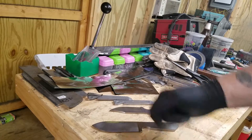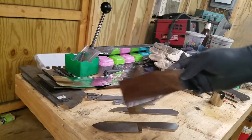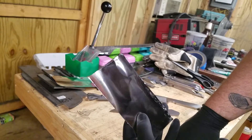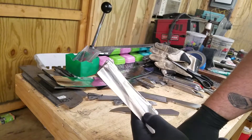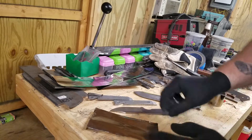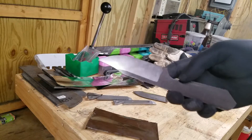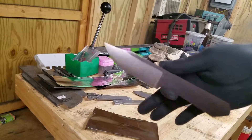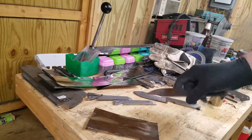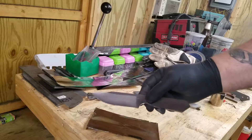What I'm going to show you right now is the stainless steel tool wrap for heat treating. Basically it's to keep the oxygen off of your steel. It creates an environment where there's not going to be a whole lot of decarb. If I were to stick this piece of stainless in that furnace and let it go up to 2,000 degrees, it would come out looking like a fried marshmallow — just nasty. So we use the tool wrap to keep it looking pretty clean.